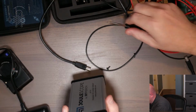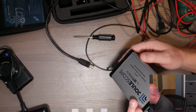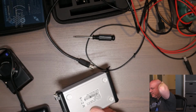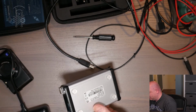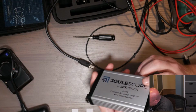I'm thinking there's an FPGA or CPLD. Yeah, I think those two Lattice parts are FPGAs. Both sides have microcontrollers, which doesn't surprise me, and then probably FPGAs, which is probably the firmware we saw get flashed when we plugged it in.